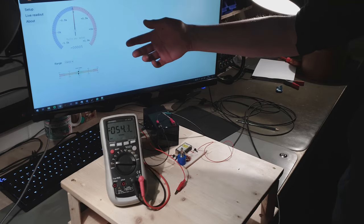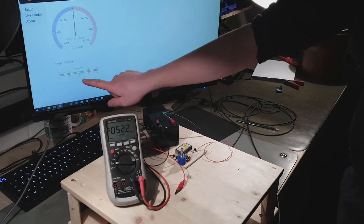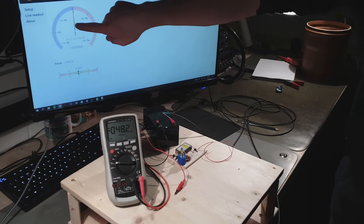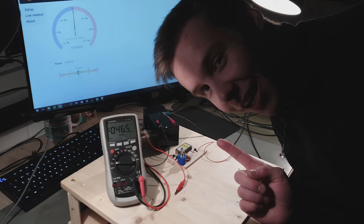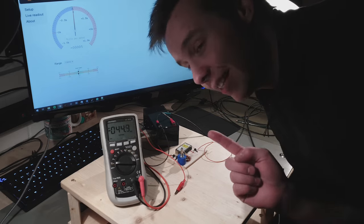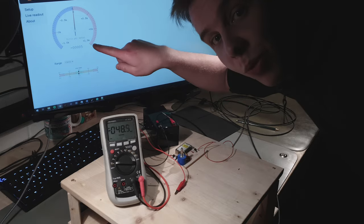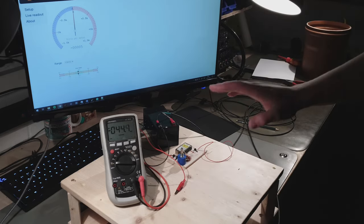Maybe I should explain that actually. This thing down here is the motor speed, which needs to be held fairly accurately. This thing jumping around a bit is probably just from me moving it. If the speed is twice as high, the reading here will be twice as high as well. And keep that in mind, because I might have made a slight mistake with the calibration, because I calibrated it for a slower field mill, the one that I built before. So the reading that will be shown here is going to be twice what we actually apply. But we're going to get to that later.